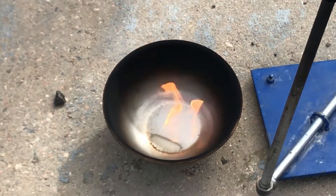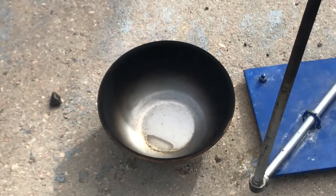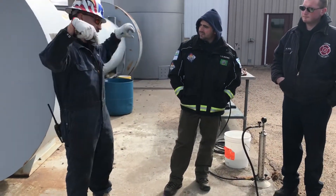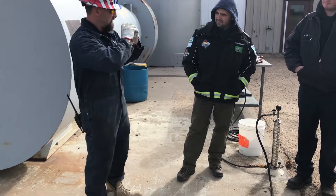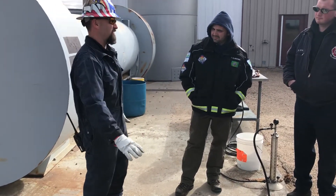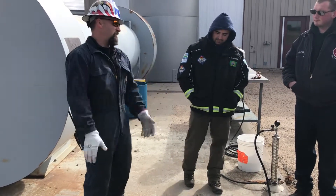From a planning perspective for a liquid flare: dig a pit, run a hose in, bury the hose, put your fusees in the pit, then open the valve. The liquid will spray out, get into its LEL range, ignite, and the churning action of putting liquid into the pit will break the insulation barrier, causing more off-gassing, more fire, and a faster burn.